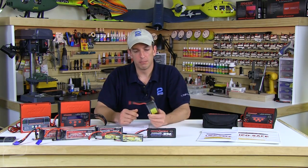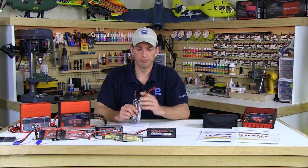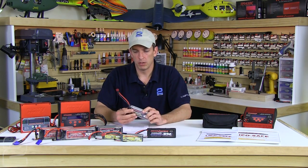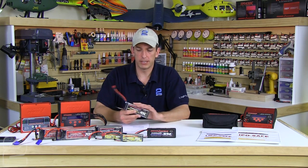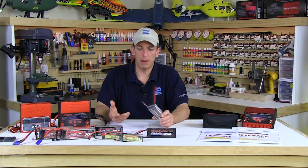If you completely discharge a pack, it's just a bag of inert ingredients. That's why you can cut off the leads, insulate them with shrink tubing if they've been discharged below 3 volts per cell, and toss them in the trash — though always check local regulations for battery disposal. The polymer is not an electrolytic acid; it's not caustic. It truly is an inert battery when completely discharged.